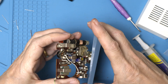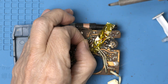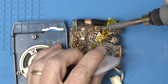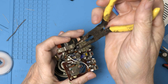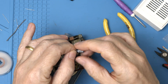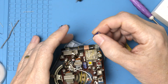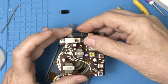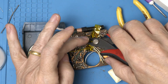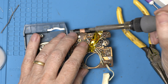Let's get to number three. I don't want to singe these wires, so let's protect them with some Kapton tape and let's get the green wire out of the way too. Got him — he is 30 microfarads, plus is to the left. Long lead is the plus, so in it goes. The new capacitor is in; now let's reattach the green wire.